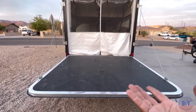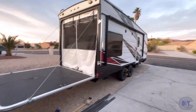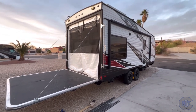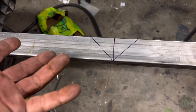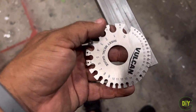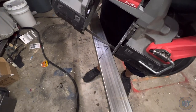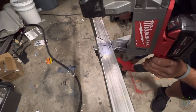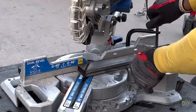All they are is trampoline mesh, rivets, and some steel tubing. We're going to cut this up and weld it up. A little porch area on a trailer this small is pretty crucial for versatility, but space is an issue, so let's create some space. We're using 1x2 tubing, 16-gauge — I probably would go smaller; 18-gauge is the next size down. We also have .030 wire. You could honestly do this whole thing with just rivets and corner brackets, or even PVC tubing and dog screen, but we're going for something more long-lasting and robust with 16-gauge steel tubing.